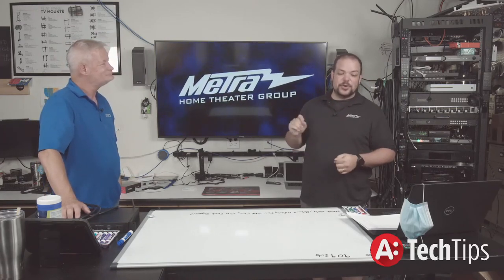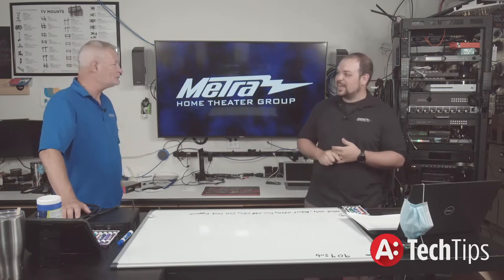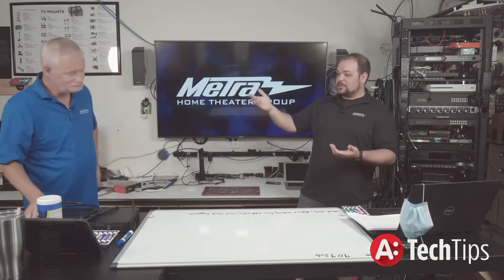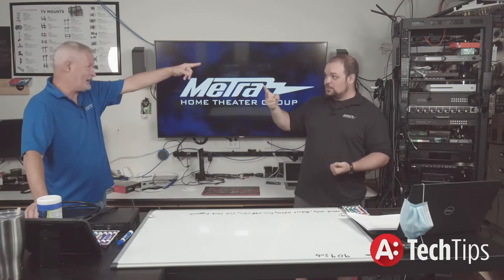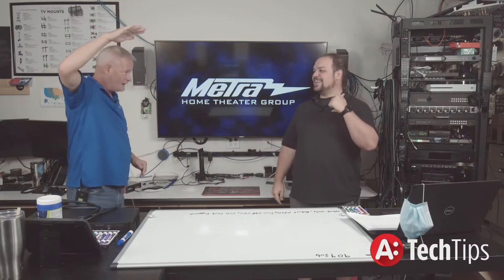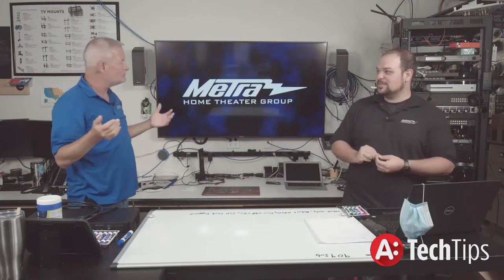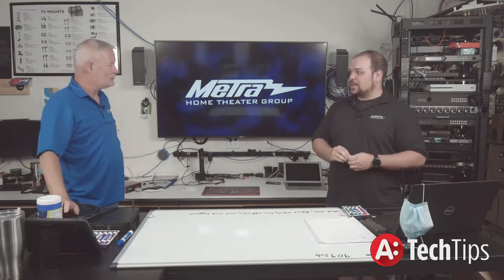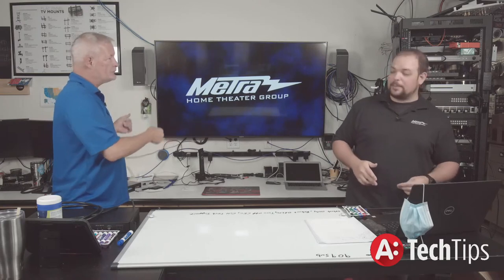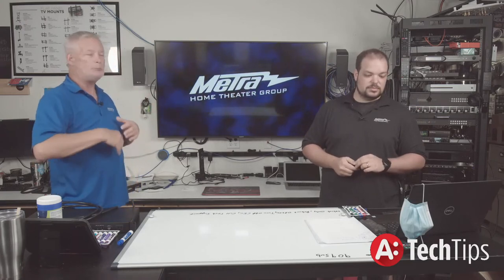Feitonia is saying you should probably use a 42U rack when you only need 24U — space everything out and get all that heat dissipation out there. If you can get at least six feet of rack, get six feet of rack even if you don't need it. You can always put drawers in it. We have two racks that size because we needed to separate the networking and security products in one rack, and all the AV and control in the other. That also gives us the ability to really localize power control of the devices.